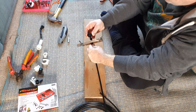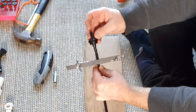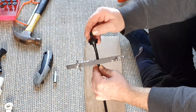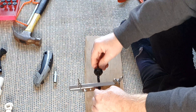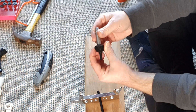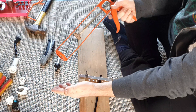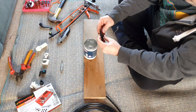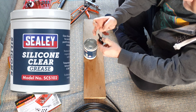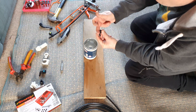I'm going to push this one-way valve onto this piece of pipe. I don't want to just push on that end — I risk damaging or snapping off the barbed portion, or even splitting it without knowing. So I'm going to use a deep but small-sized socket to put over that so I can push on the main body, and for the pushing I'm using a dead cheap caulk gun. Before you put your fitting in, put a little bit of silicone grease on the barbed end — it only needs a smear.